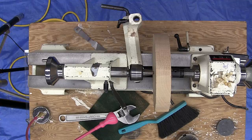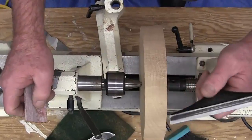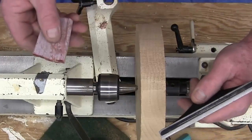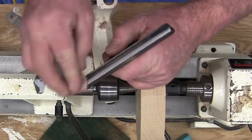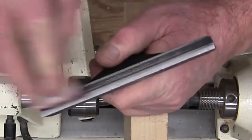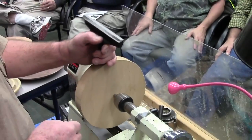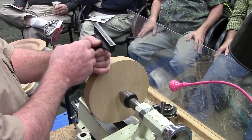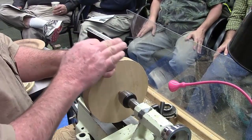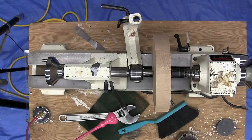If you're working on a fresh piece of wood and you have resins or juices flying off, it'll land on your tool rest. Just take some sandpaper and scuff it back. You don't have to file it. Okay, this just dresses it up finer, just like the sharpening of your tools. You may start with a coarser wheel and go to a finer wheel, then hone it. And you're getting a nice, smooth, slick surface now to follow.